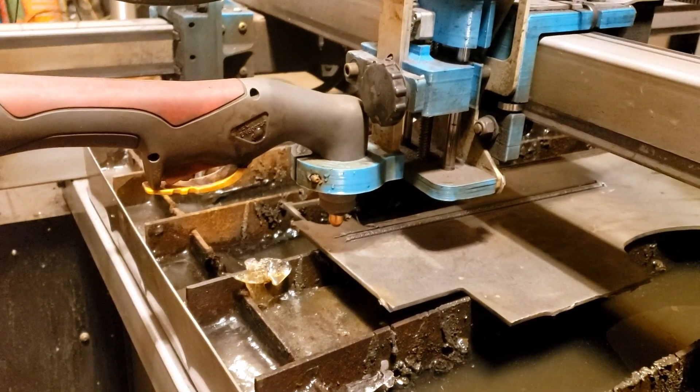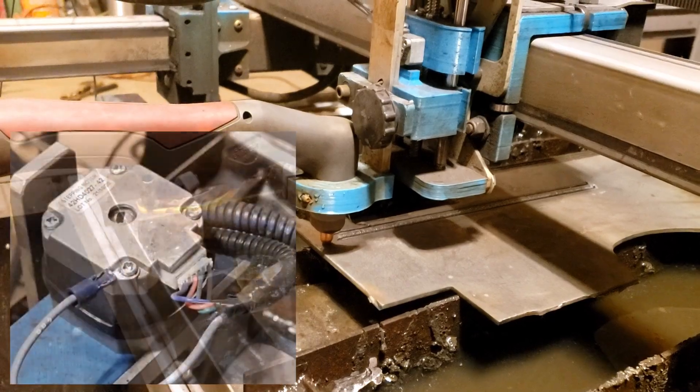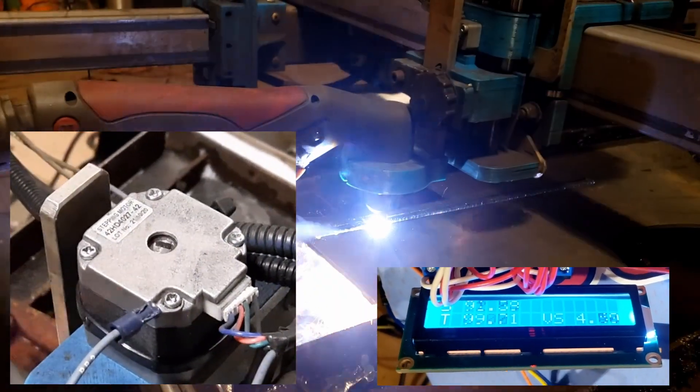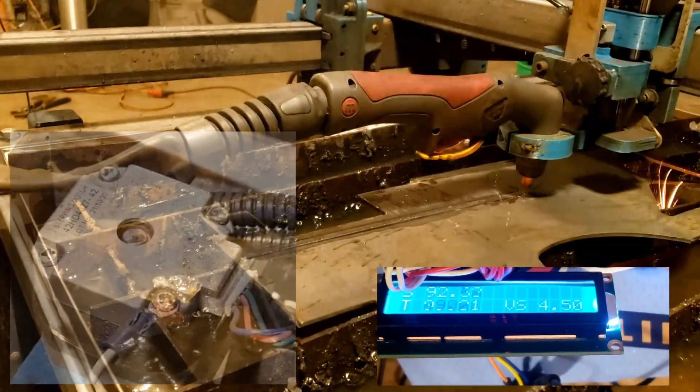Jackson's filming the top of the stepper motor to see what action we're getting. We got the third cut — looks really nice. We set the voltage at 92 volts. When we watched the top of the cut, it did a little bit on the initial after the pierce, but it pretty much stayed the same. We expected that because it's a really flat piece of metal. So we're going to see if we can get this torch height controller to work on some bent metal.